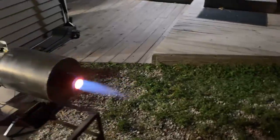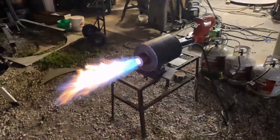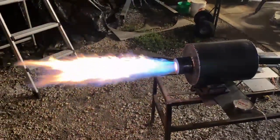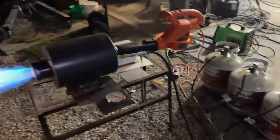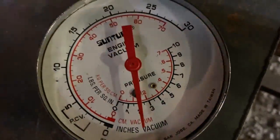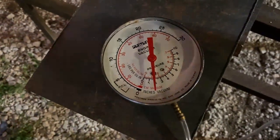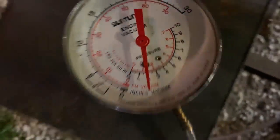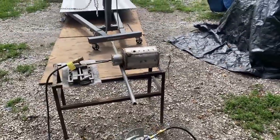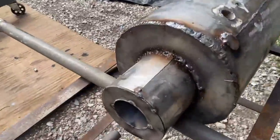We're back out here at White Sands tonight doing some testing on a burner for a large furnace build I have coming up. The problem is it's going to be a natural gas burner, and a natural gas municipal supply is anywhere from 2 to 7 psi from what I've heard. So we have to build a burner that can run at very high outputs at about 2 psi until I get word back from this factory about their actual gas pressure — I'm hoping they have 7 psi.